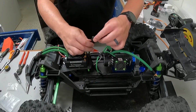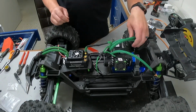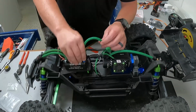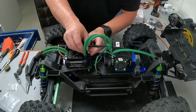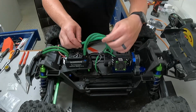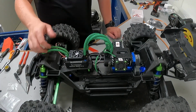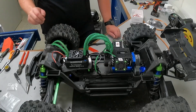And so you'll throw your sensor wire on, and with this setup being sensored and everything, you do have to run A to A, B to B, C to C, so it's going to slightly go in a cross orientation. Clean that up and decide how I like it most, but you get the gist. And we will go ahead and decide our power switch location, wherever seems to work the best for the ESC, as well as mount up the on-off switch for the Hyperflow fans.